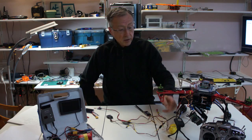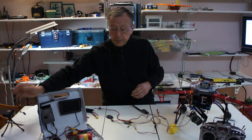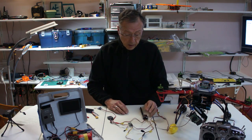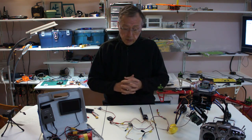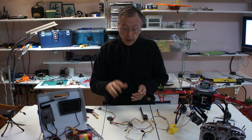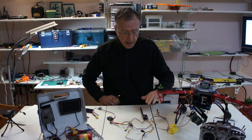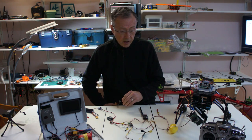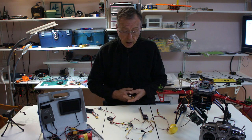It's really part of the quad build over here, and this is an extension. I have done other videos dealing with how to wire up the FPV with the OSD, with the video transmitter, the OSD, and the GPS. That was a while ago and it really focused on just using a single source of power — a one or three cell battery for both your plane and your video transmitter equipment. Because we're moving into larger batteries and there's a wide arrangement of components necessary to do FPV, and they all require different voltages, we're going to be looking at using multiple power sources in this video.